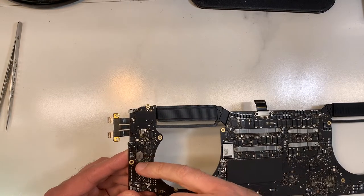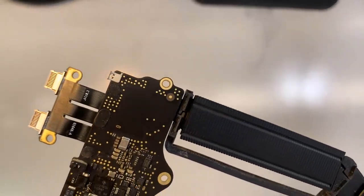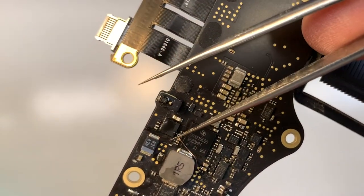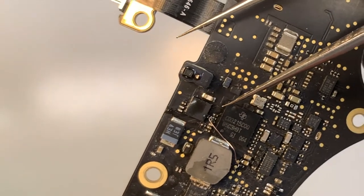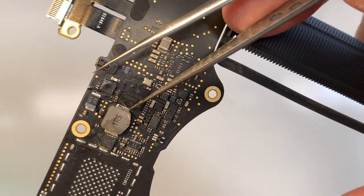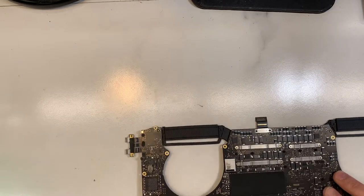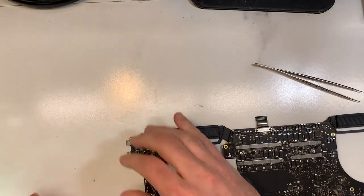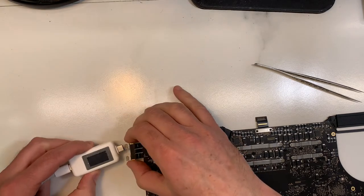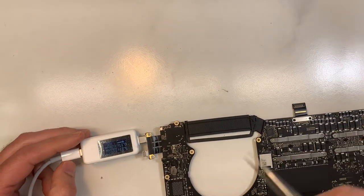So I already put half of it. Let me see if I can show you. You can see the resistors over here with a broken trace — one of the resistors, the pad is completely gone, so I had to join both here. I haven't plugged in the wire yet. I'm going to show you that it's still stuck at 5 volts. See? Still stuck at 5 volts.